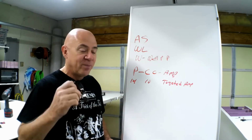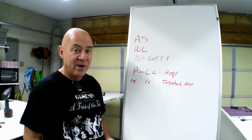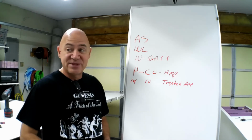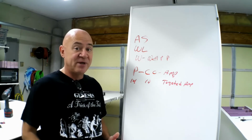Okay? I know people that fly 100 amp speed controllers at 60 amps because they're afraid of blowing them up. If you know and can track that you're flying it at 90 amps and it blows up, send it back to the manufacturer and tell them to pound salt. You want your money back. You got a shitty speed controller.